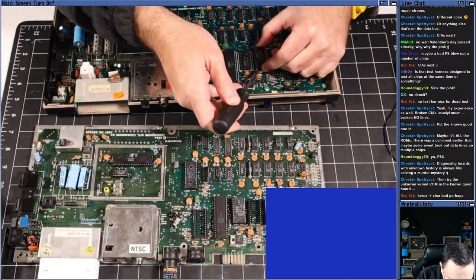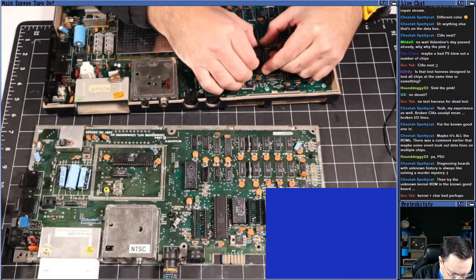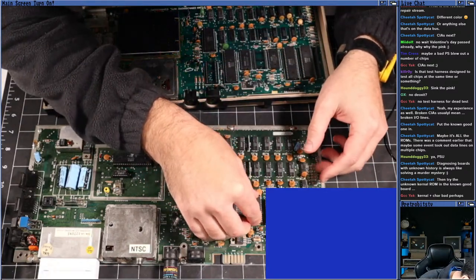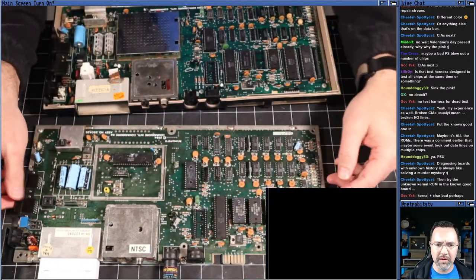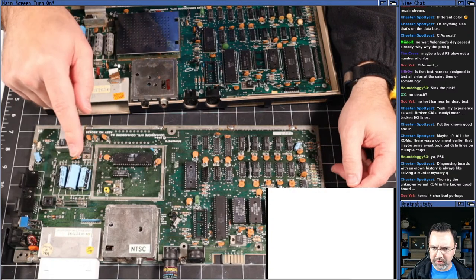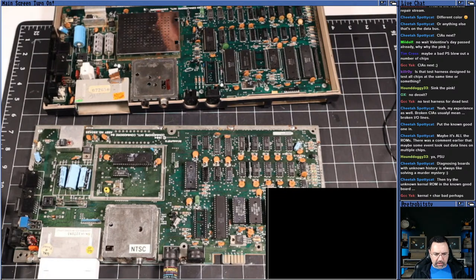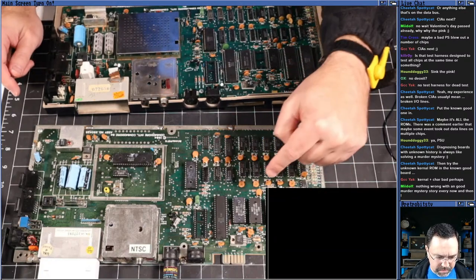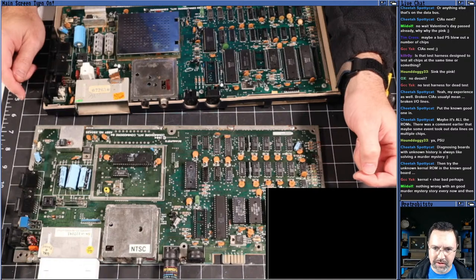My 227, that is the right chip, 227. Yep, here we go. My kernel ROM going in. The only difference now is it's got Deoxit in there. Okay, I saw a flash. Okay, we have one flash. So now we've moved on. We've identified that this has a bad kernel ROM and we've gotten to a single flash state. Very cool.